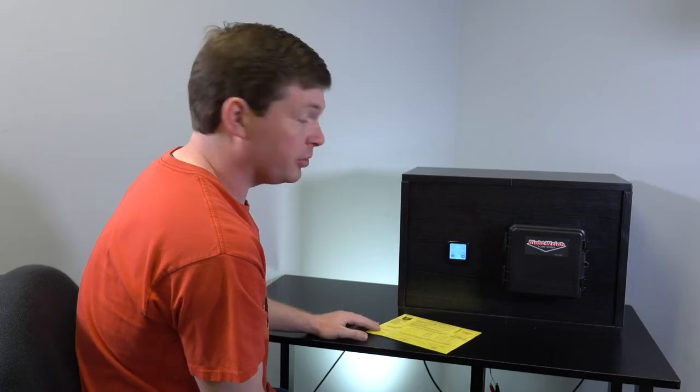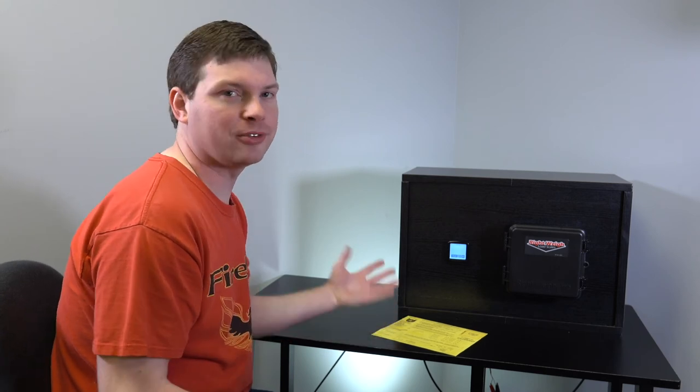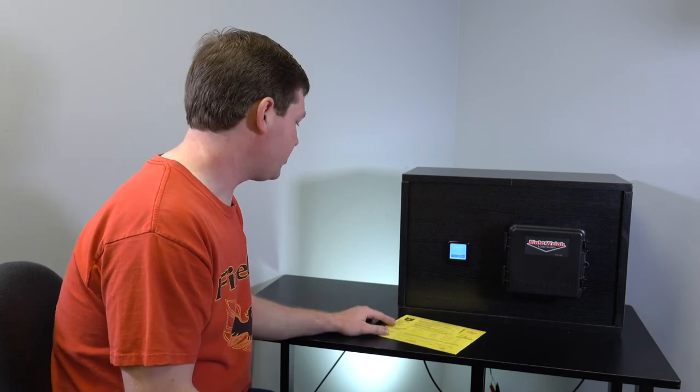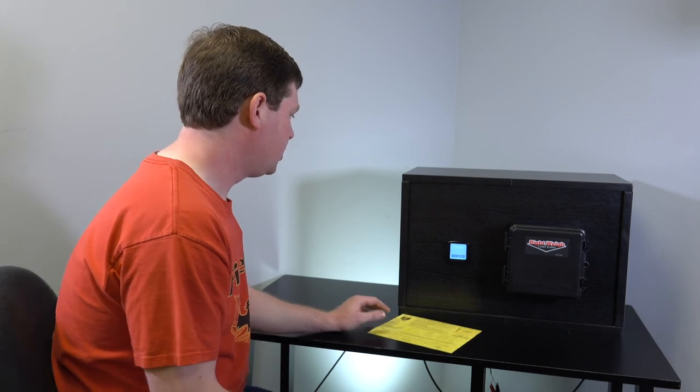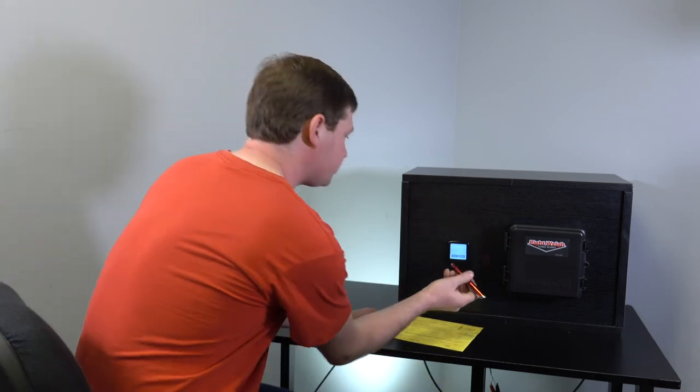Now I'm going to raise up the air pressure, go into the gauge, and we'll do our loaded calibration. Okay, we got the air pressure raised up. I set it to about 65 PSI, which is where typically a loaded drive axle would be. And we're going to do the heavy calibration. So we got our other CAT scale ticket here for loaded.